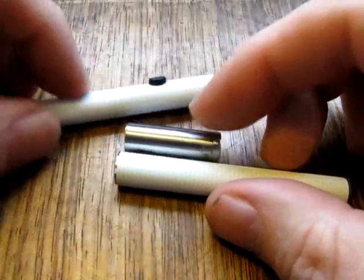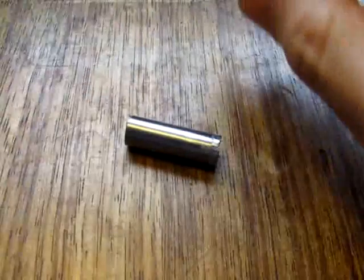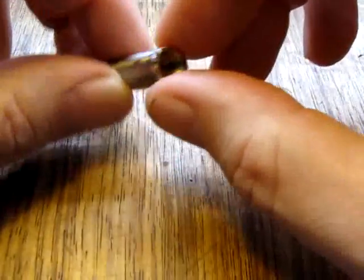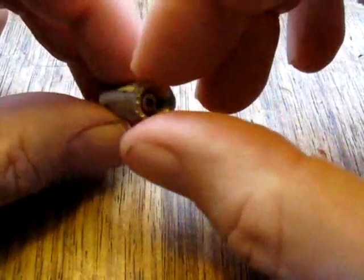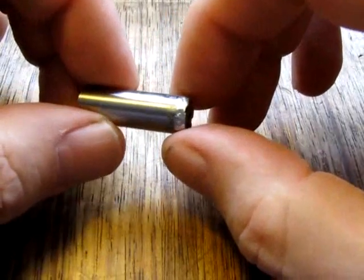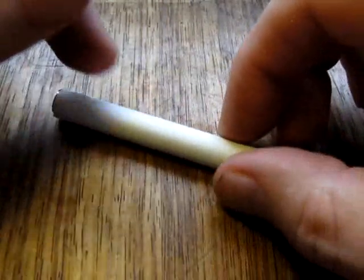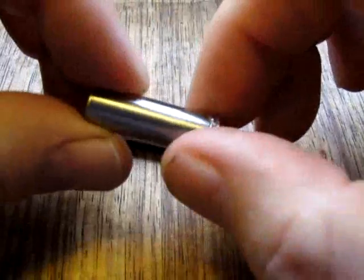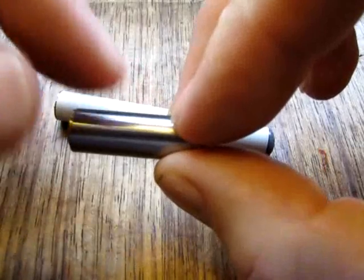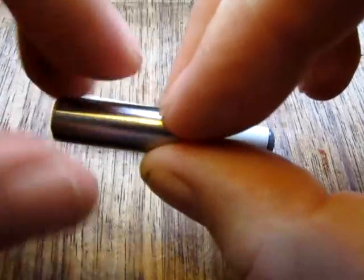and then all you need to do is connect the two together by soldering a couple of wires, one to the positive end of the Super battery connector and the positive end of the Titan battery connector, and the same for the negatives. This metal casing is the rest of the Super battery here, which I took the paint off simply by plugging it into the chuck of a drill, spinning the drill, and with a piece of sandpaper, just holding the sandpaper gently over it, and that just very nicely takes off the paint.